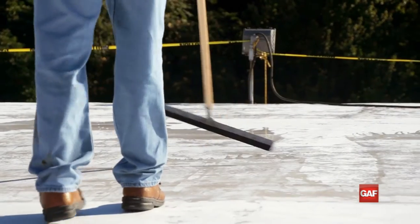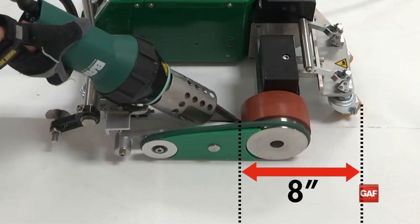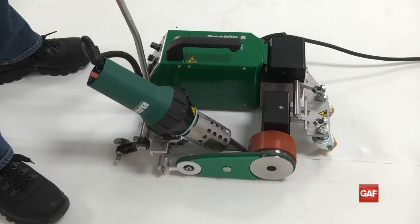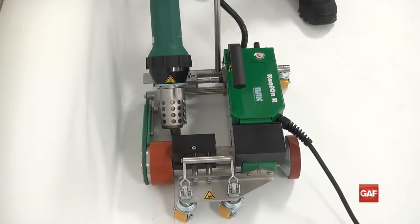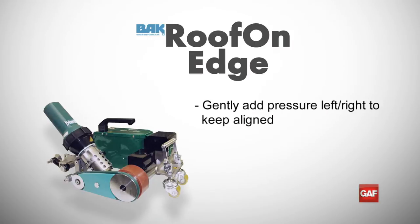You always want to make sure your single-ply material is clean and dry, as wet membrane will not weld. The weld should start about 8 inches from the end of the seam. To start the welding process, just slide the nozzle into the seam. Once fully inserted, the machine will automatically start welding. Be sure to watch the alignment of the guide wheel and the pressure wheel to stay on the edge of the seam. If you need to adjust the alignment, gently add pressure to the handle to the left or right to correct it. Never lift the welder to adjust, as you will lose the pressure on the weld, causing potential void or failure.